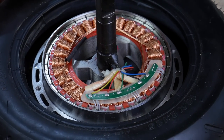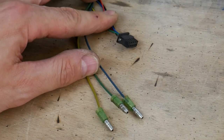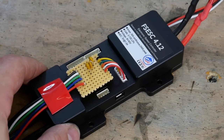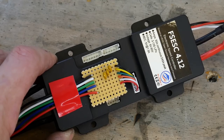The motor has hall effect sensors and 30 magnet poles, which is pretty standard for these wheels. I found the setup process was easy enough on some VESC clones made by FlipSky. The hall effect sensors are pretty noisy though, so I added some additional capacitors at the motor driver end of the cable which allowed the auto detection to complete.